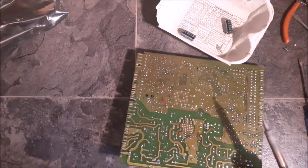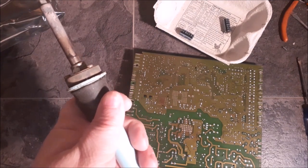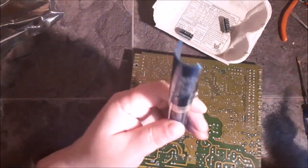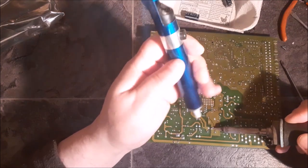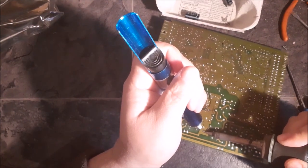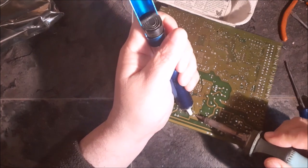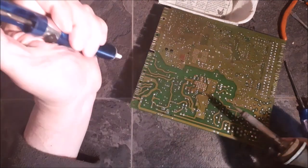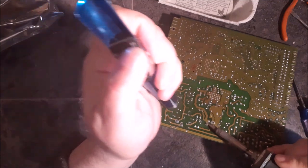Like I said, these things will get tested. I just need my desolder pump after all. There we go, it's up there on the shelf, gathering dust. There we are. One solder up, get out the flux. Oh, not quite got it all on that one. There we go. Take off as much as I can. You can re-solder these, reflow them to put some fresh solder on.